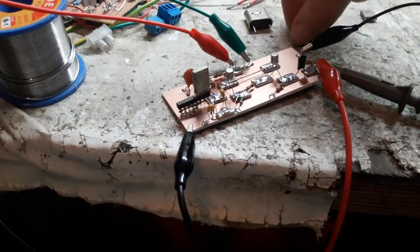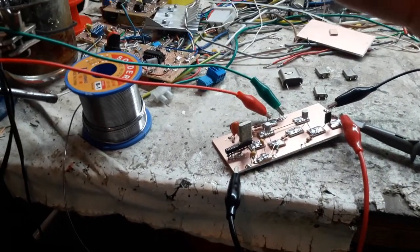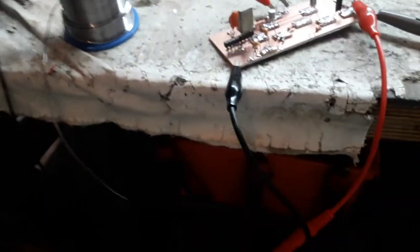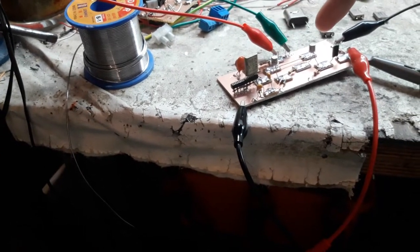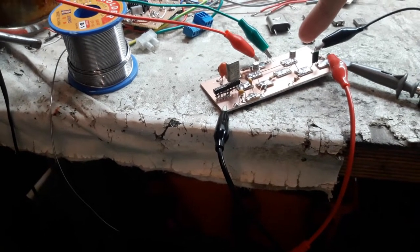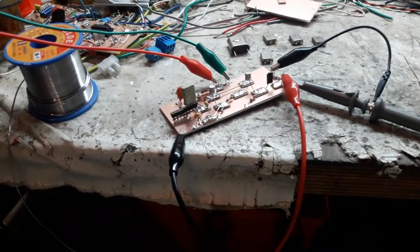So I have some various crystals here. I wanted to test out a couple of crystals because I wanted to use them for a future project. These are 4-meg crystals. So basically the back end here is the Colpitts oscillator, and then the front portion is just a buffering stage. I'm assuming that's there to make this more of like a line output, so you can put your test equipment on there to get a good reading. It does work.